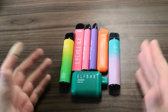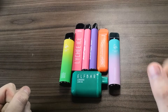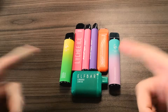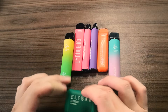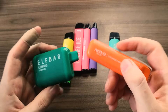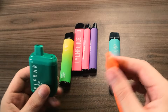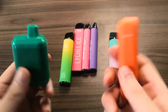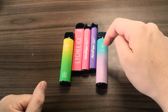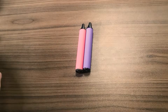These are the vapes I have available for our demonstration today. As some of you may have guessed, I am South African, so I only have access to the locally distributed ones, but many of these brands are international, so these skills should carry across. Please excuse the state of my hands — I have recently started rock climbing, and it's been a bit of a rough week. Now, to open these things up, we need to first make a few executive decisions. This elf bar and this nova bar are both made of a hard, rigid plastic. A previous attempt to get in here has actually damaged it quite badly, and so these aren't really worth refurbishing — you're going to do so much damage to the exterior that you'll end up destroying them and making them really unpleasant to use. Instead, we can strip these for their batteries, which I will show later. Our remaining vapes are pretty much identical internally. We have two large cylindrical ones, two small cylindrical ones, and a flat rectangular one. Since the smaller ones are a little bit easier to deal with, we're going to start with those.